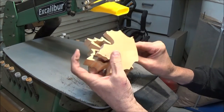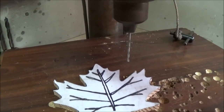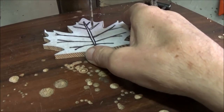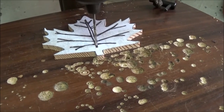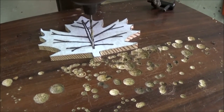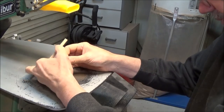That's all done — now I can just push that center piece out and bin it. Now it's time to cut out the leaf veins. I need a locating hole for the blade again. The front's only a quarter inch, so I'm using a number 5 blade. It's a lot easier to get around those sharp corners as well.